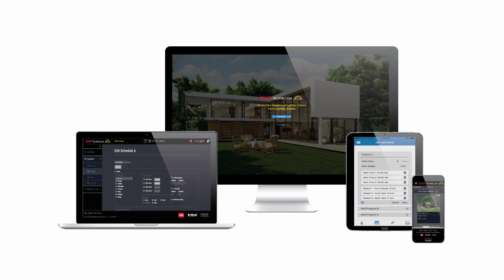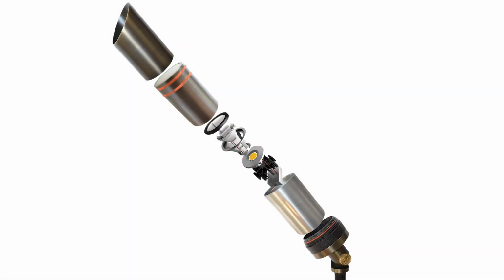All of this control with the CCT, the RGB color, as well as the beam control is all part of the SmartScape platform currently in use today. Since INSPIRA interface is built on this existing platform, current SmartScape users do not need to purchase any additional hardware or make any changes to their existing system to use new INSPIRA fixtures. Since everything is built into the fixture, it is not necessary to make any mechanical adjustments, change lamps, or swap out reflectors or other hardware in order to alter the beam angle or any of the colors.